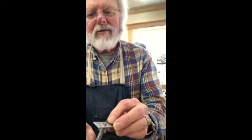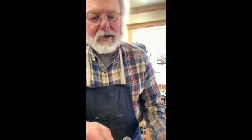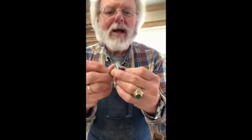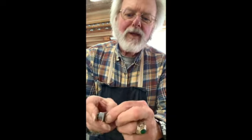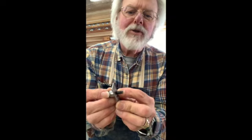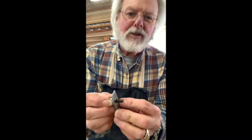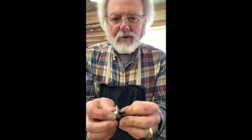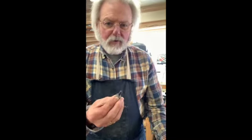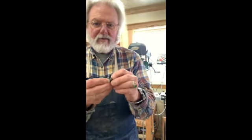So I'm just going to make a ring that's going to help me extend this, and that's necessary because when this bolt passes through it and you put a nut on the other side, it has to meet that bushing before it meets this piece of steel, otherwise it's going to lock it down and keep it from rocking as expected and as designed. So we're going to go over to the lathe and make those little bushings.